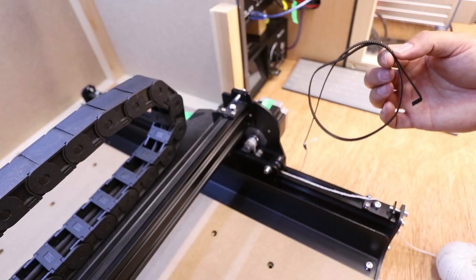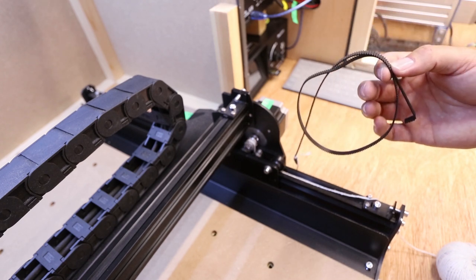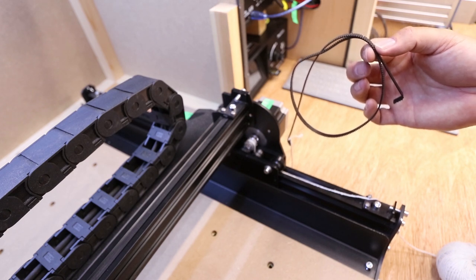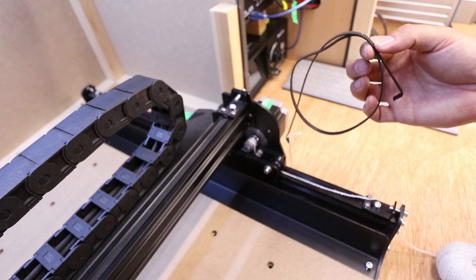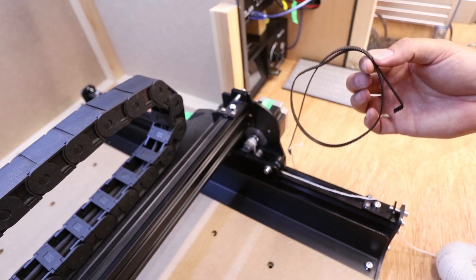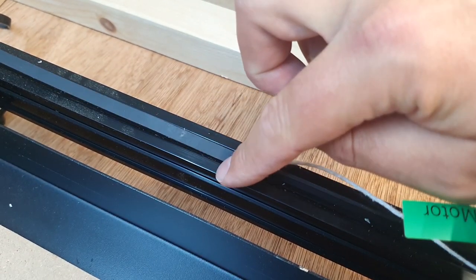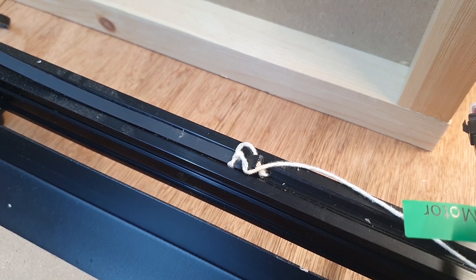For the purpose of this tutorial I am simply refitting the existing belts back in place, but I wanted to show the process of how to remove and refit them through the carriage system. If you are ordering new belts, you need to order lengths of around 65cm — approximately 26 inches. That is a fraction more than you actually need, but it's better to have too much than too little. Alternatively, you can order a very long length and cut it down to size. When feeding the belt back through, make sure the teeth are facing down into the extrusion and the flat piece is on top, to ensure it grips the teeth on the stepper motor.